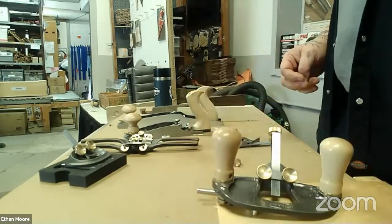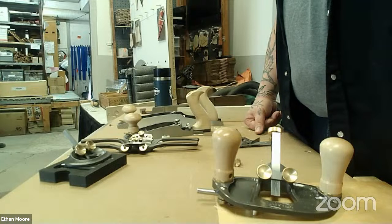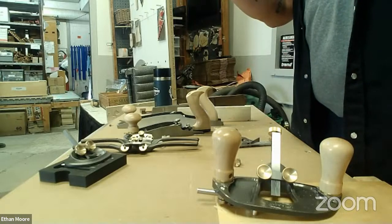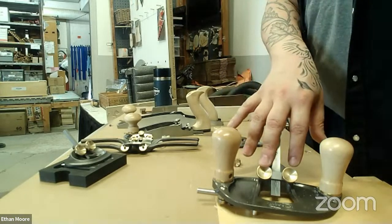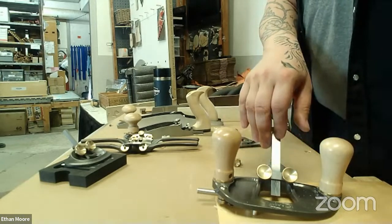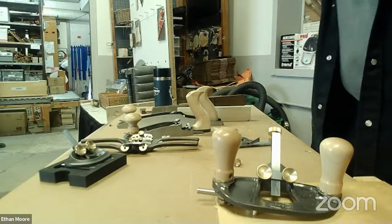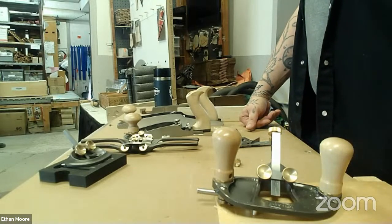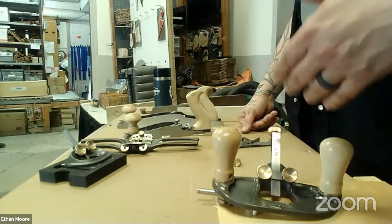Depends on the work you're doing. If you do a mortise on a very narrow piece of wood, it depends what you're doing. The other thing with the old style of blade is that when you got it deep into a piece of wood, it would chatter terribly. In this case, you get very little chatter. Where would you use this in a modern shop? If you cut a dado and had to make it slightly deeper, but you've already torn down whatever machine you were using — whether a dado blade on a table saw or a router table — if you try to set it all up again and get it to match, it's never going to work. This will allow you to just quickly and easily do that.